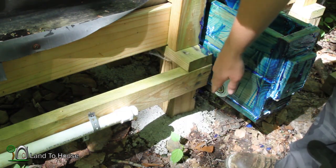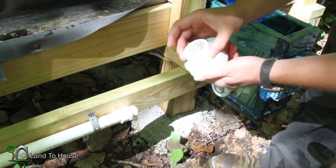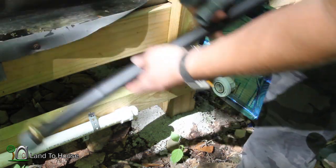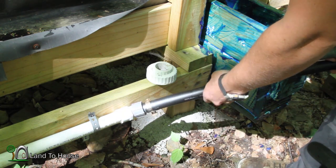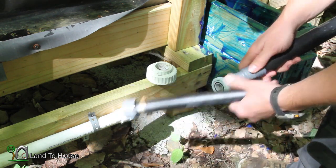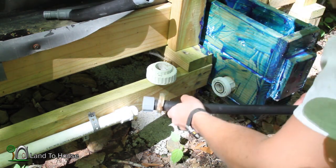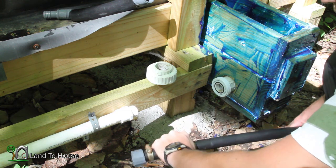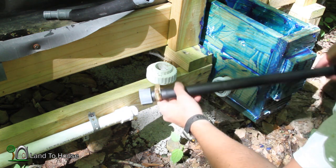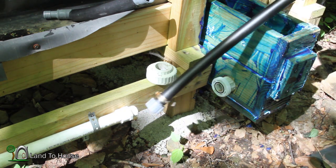Now to span this gap, here's what I'm thinking. I've got the other side of this union here that I'll use, and then I've got some one-inch pipe here that can be screwed on, and then I've got this one-and-a-quarter that can be attached to this one. There's a little bit of an issue about getting it at this angle, but I'm hoping this will flex just enough that I can get it over there — it's not much of an angle but it might pose a little bit of an issue.